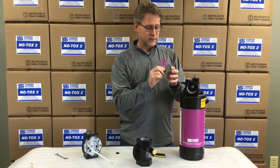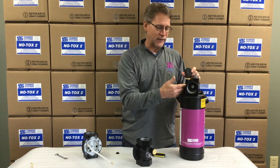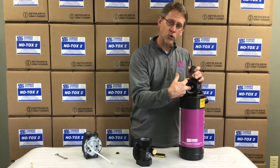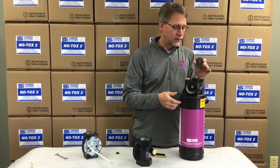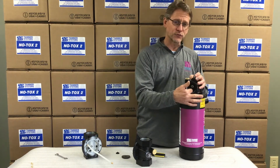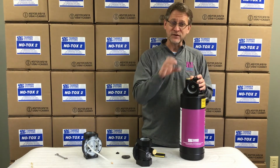It's fairly stiff. If yours is bent back like so, or maybe even is missing a couple of ears, just replace the flow guide. We need the flow guide to redirect a small amount of your air into a little hole in the side chamber here. That hole is what then pressurizes the bowl. The flow guide, some people call it a restrictor plate, just redirects enough air to pressurize this tank. Check the flow guide. Also, the flow guide screw. This one is held in place by a brass screw with a fairly large washer. The T83, T85 have a smaller washer.